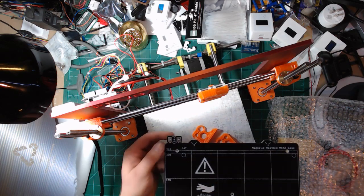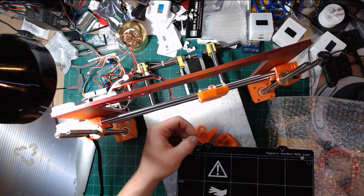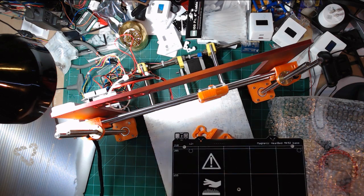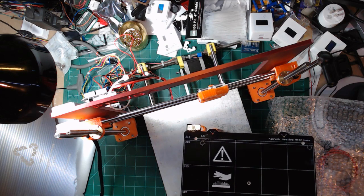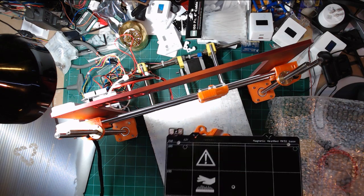And on the PCB you have your, I mean, this is a PCB, right? But on the PCB you have your pads. These are the pads where the heat bed connects to, and right from those pads, the copper basically allows the electricity to go through, and in this case it's thin enough where it generates heat. So that's how the bed works.